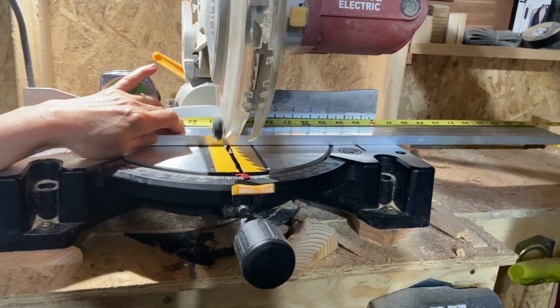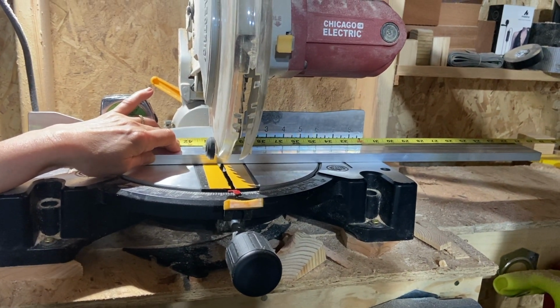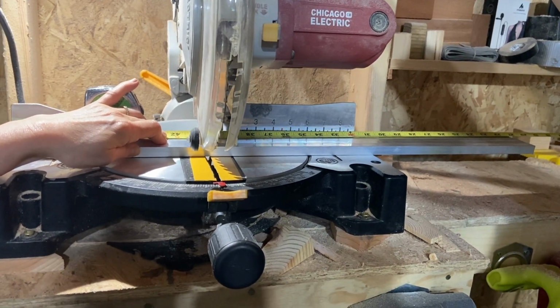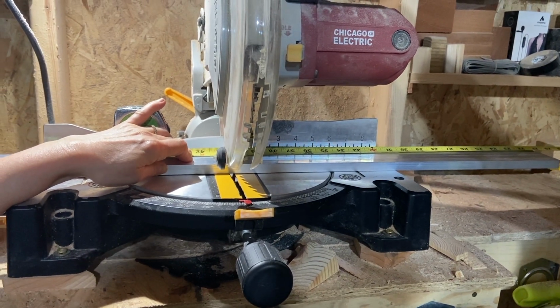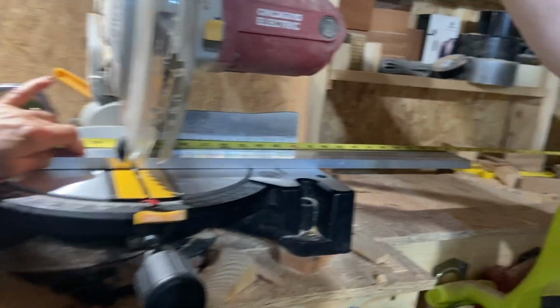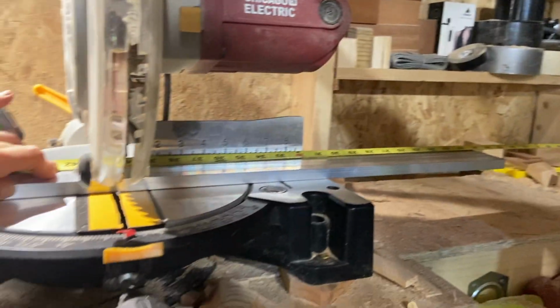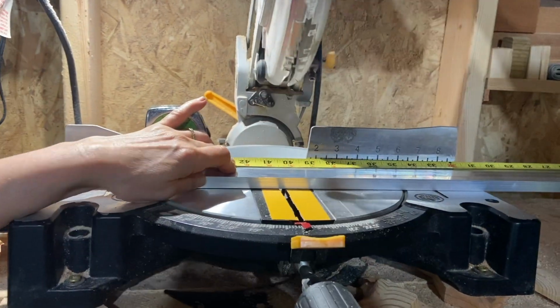One of the reasons we chose aluminium versus steel is that all the tools we have will cut and mill aluminium. Our drills will go through it. Everything is the same tools. We don't need additional tools. So we want our height of the furniture we're building to be 40 inches, we said. So we have set our stop exactly like we do for wood, and we are going to have our 4 pieces of aluminum touch that. So let's progress them.